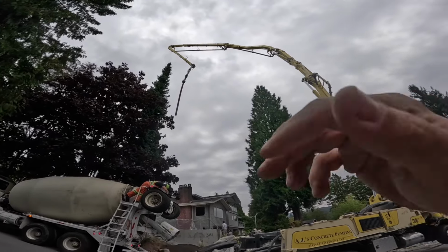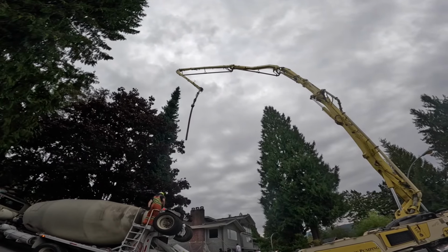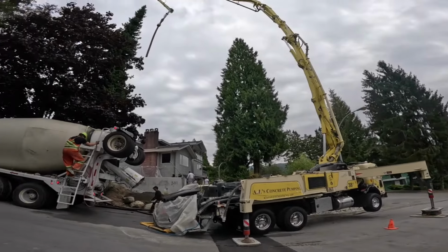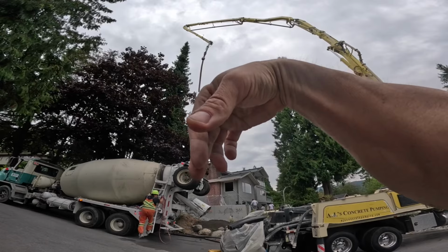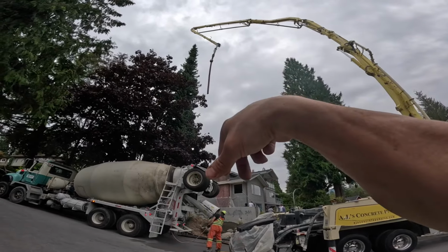Obviously, if you're on a job site with clearance restrictions or whatever, doing it this way is not an option. There are other ways, but that's a future video. But for most of the jobs I do, pump out in a bit of an arc, as much of a roll as you can with a 5-section Z boom. Let that tip section drain out for a few seconds.